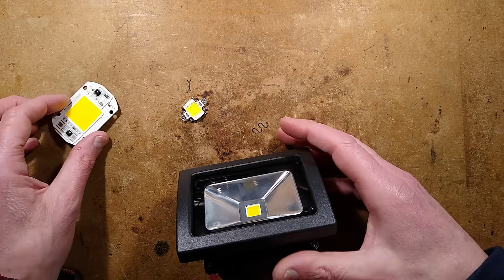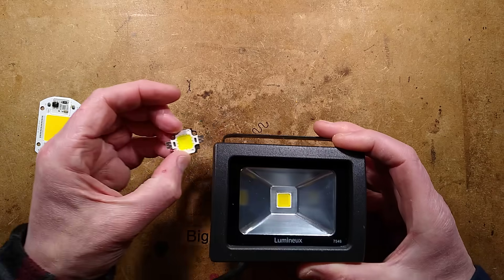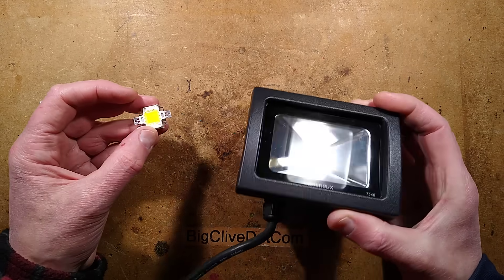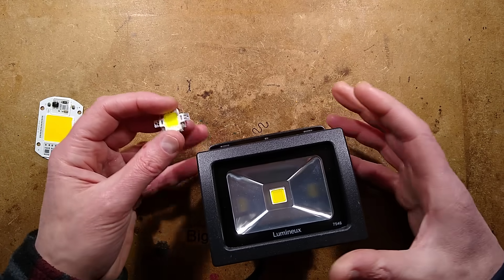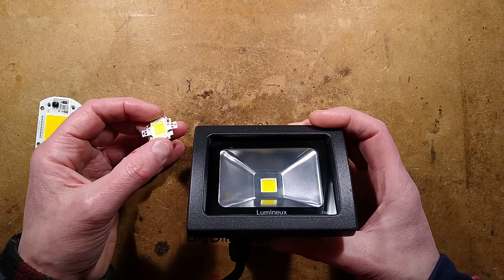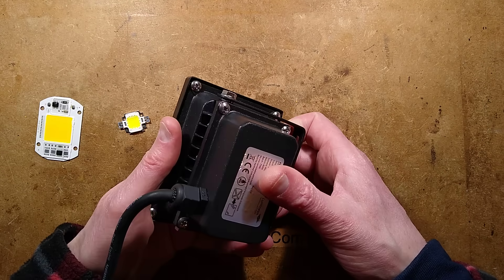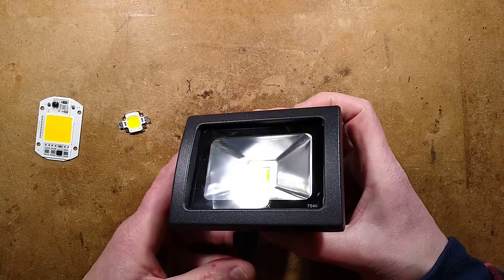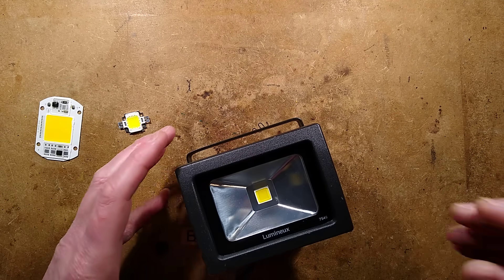These original LED floodlights didn't flicker because they used little 10-watt LEDs like this and tended to use switch-mode power supplies inside. Recently someone got in touch — I couldn't find their email otherwise I'd have mentioned their name — but they said there's a company selling off their old stock very cheaply. So I bought a box, and let's try it out and then take it apart to refresh our minds as to what it used to be like.